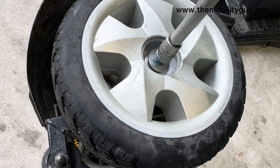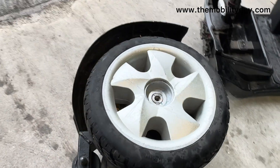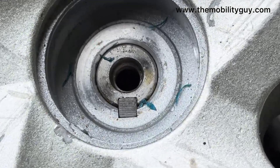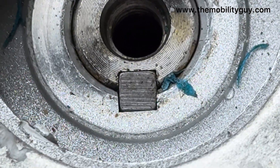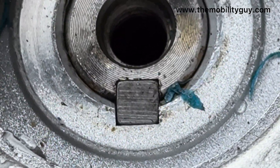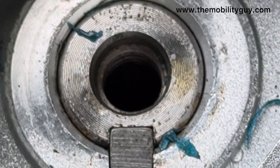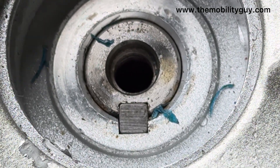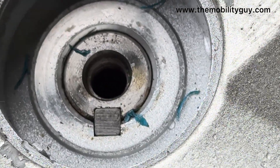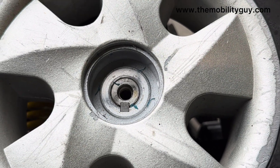I've pre-loosened this wheel. Now the most important thing — do not lose this little square piece. That is your key. Without that in the wheel it'll just spin — it's like a CV joint or an axle. That center bit with the hole will spin, and without the key connecting the axle to the outer wheel, you'll go to drive and just spin in place. Trust me, I've done it a few times — it's not nice at all.